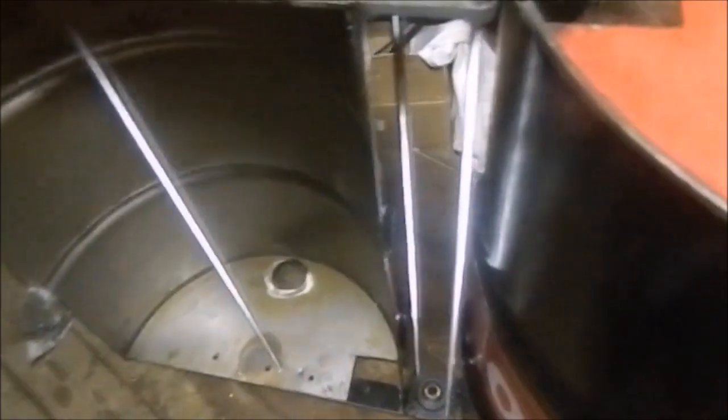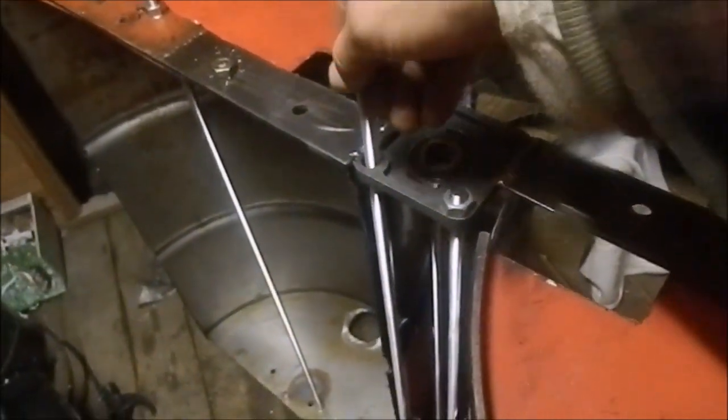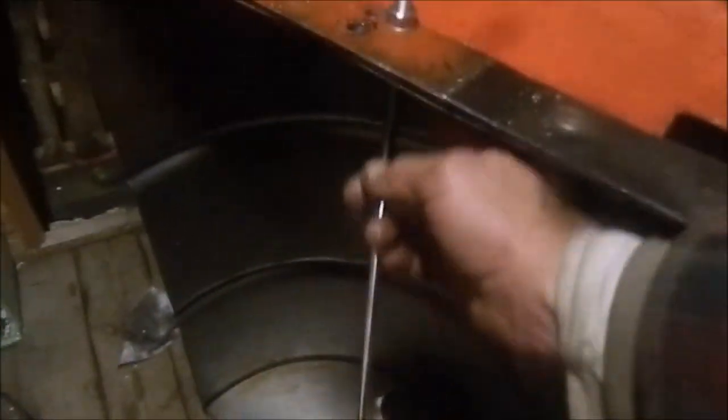So this is what I've ended up with - those two supports in the middle. When I get another bit of threaded bar I'm going to have four, holding the bearing together. I need to buy some more M10 nuts. These will have M10 nuts on the inside and the outside so we'll be able to adjust it that way and that way. I don't think this will affect the airflow too much when you consider the fraction of that to the overall theoretical blade area. So that's definitely progress.